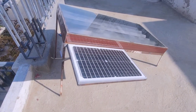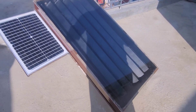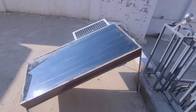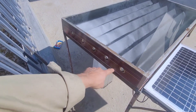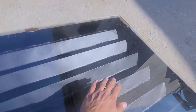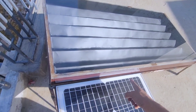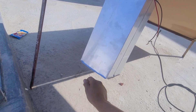Now let's move to project number two. This project functions the same way and gives you heat through the sun — it doesn't cost much either. A fan is fixed in this project as well, and a small solar panel is used to run the fan. This system works automatically. When cold air enters through the holes, the steel sheets — painted black with glass placed on them — prevent cold air from escaping the frame. The sheets produce and store heat, and the air comes through the holes, becomes hot, and is transferred through a white chamber.